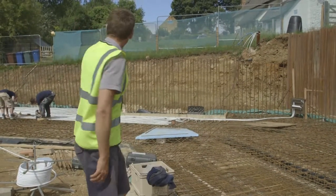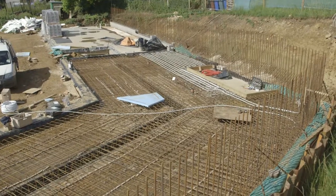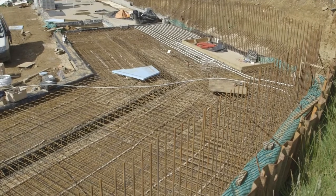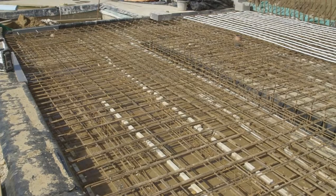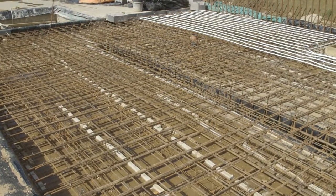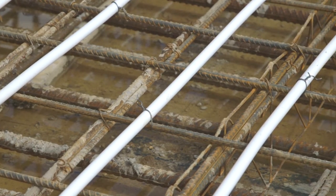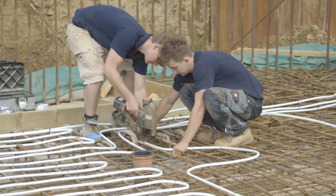You can see here this lovely polished concrete slab — it all looks really effortless and easy. But this is what's inside that concrete: an enormous tangle of steelwork that all has to be bent, transported, put in place, and wired. There are thousands and thousands of these wire loops, and there's a gun that can wire-loop them together.